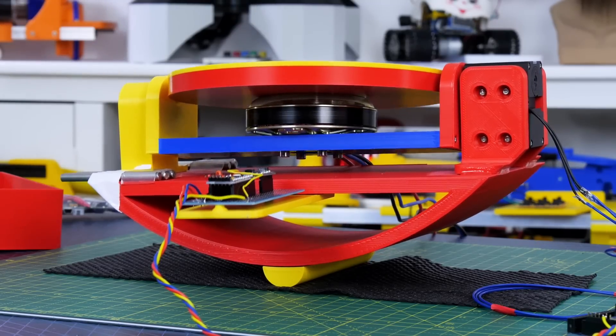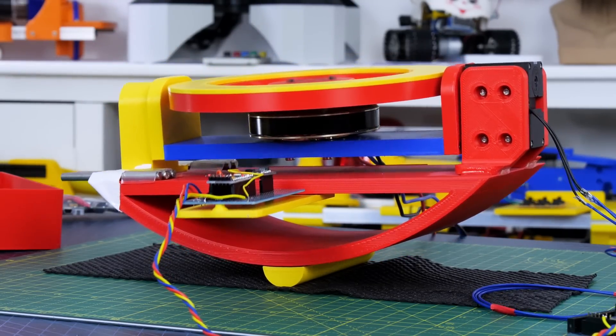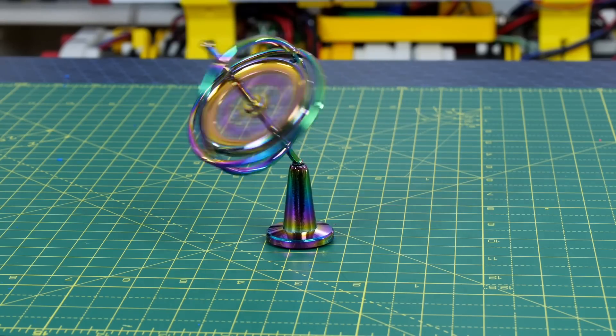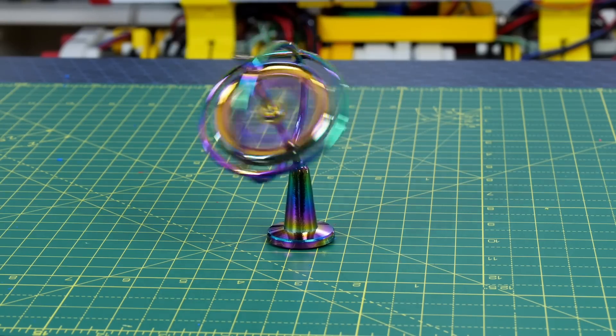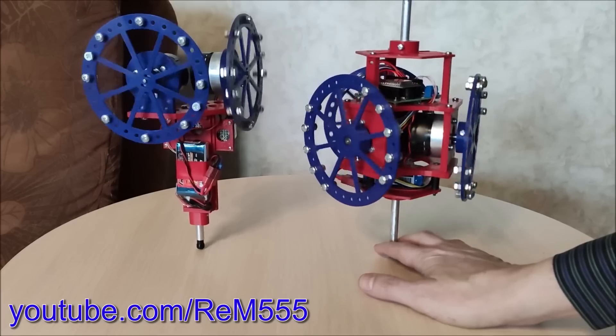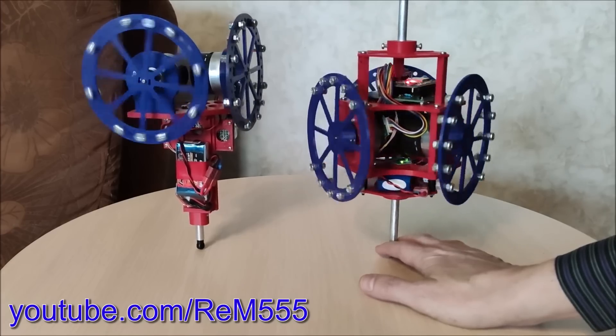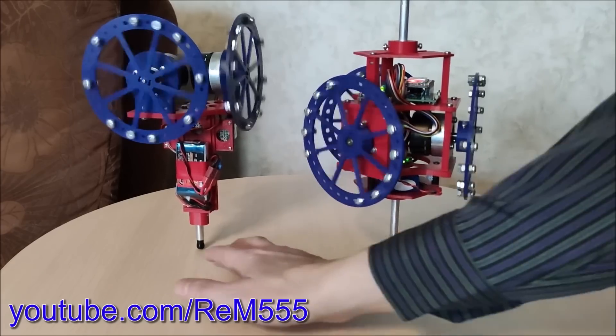However, as the gyro tilts it will still cause some gyroscopic precession in yaw, the vertical rotation axis, and this is also true for a freestanding gyroscope. Please note that this is different from a reaction wheel, which rotates a mass in opposite directions around a center point and causes an opposite force about the device to stabilize or balance it.